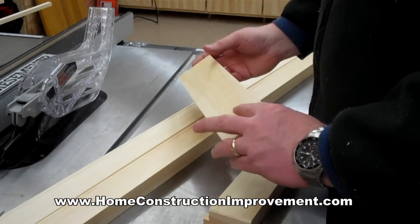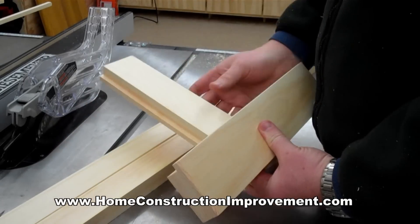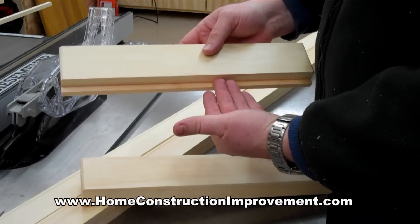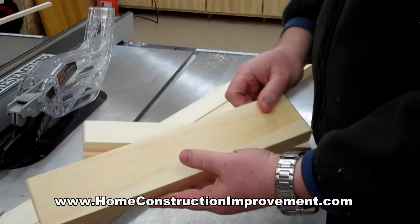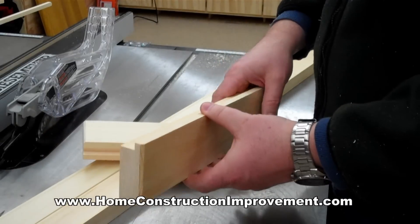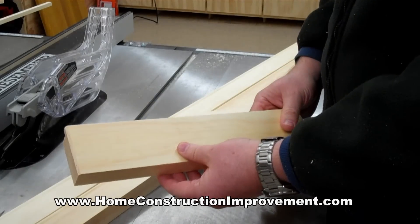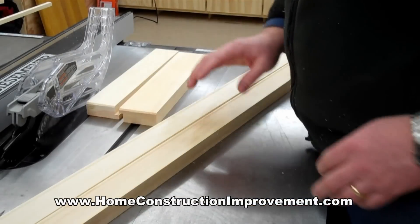To make the shutters you're going to have several components. The instructions call for both a bottom and a top rail assembly. The top one has a rabbet taken out of it so that when the louver closes, it can close flush with the others — that rabbet's on the front, whereas the bottom one's on the back side. Those can be done with a dado by running the piece through the table saw in two directions. Both of these also call for a chamfered corner, which I did on the miter saw with a stop block so they all get cut the same. That's all made out of five-quarter stock.